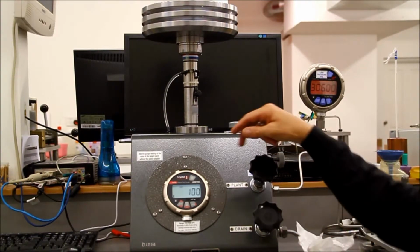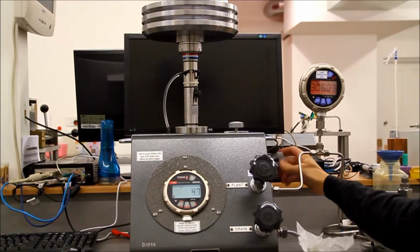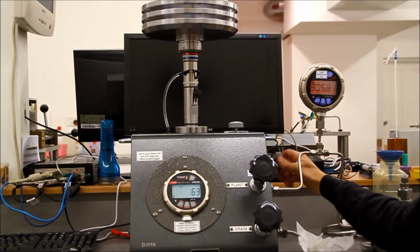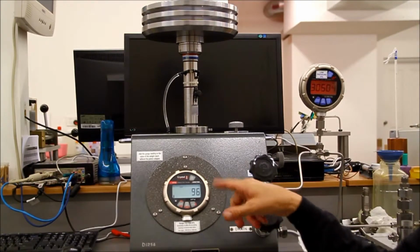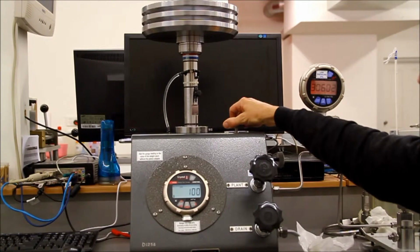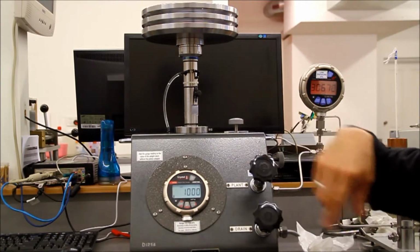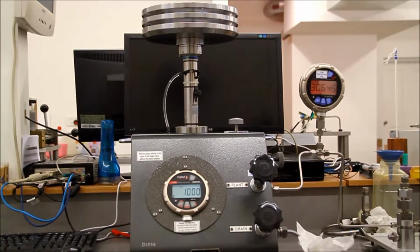So this gauge is perhaps a little more capable of withstanding some overpressure, so if we happen to go too far in pressure and go into a negative area, the pressures could be applied to minus 1000 kPa, potentially without taking any damage to the instrument. This could cope with a lot more pressure than that. Once the reading has been taken from the gauge, it is recommended that the valve on the reservoir be opened, so that any pressures are not going to be applied into the auxiliary circuit, causing any potential damage to tubing or the gauge that's in the circuit, until those things can be reset for the next time a reading needs to be taken.